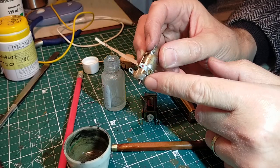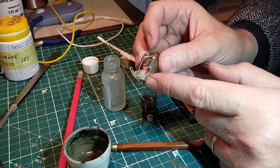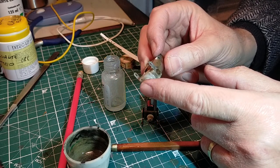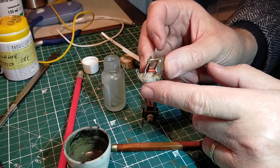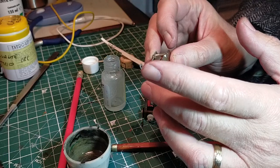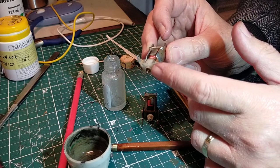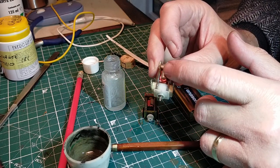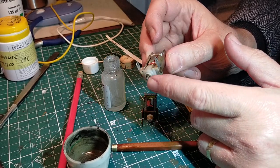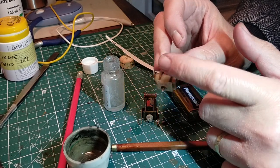I've got plans for this 5-pole motor, because one of the Jouef 030T locomotives, the red one, the one you saw in the video with the three small tank engines, the three Boyers, the red one has a 3-pole motor. That locomotive was developed and marketed with a 5-pole motor as standard. But the red one, the red and gold one, which was a sort of novelty special edition, and why on earth they made it, I'd like to know. Knowing that probably fewer people would have bought it, they plonked a 3-pole motor in it, and that's why it's so noisy. It's a really noisy 3-pole motor.